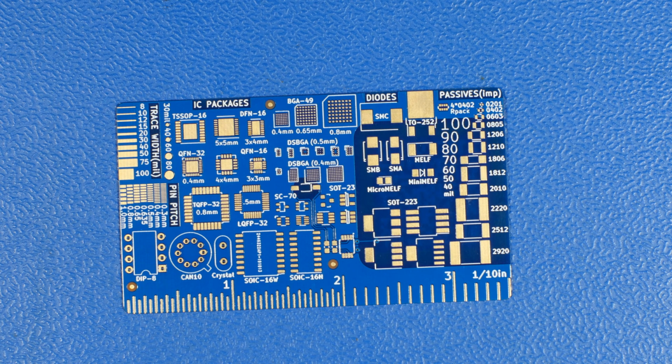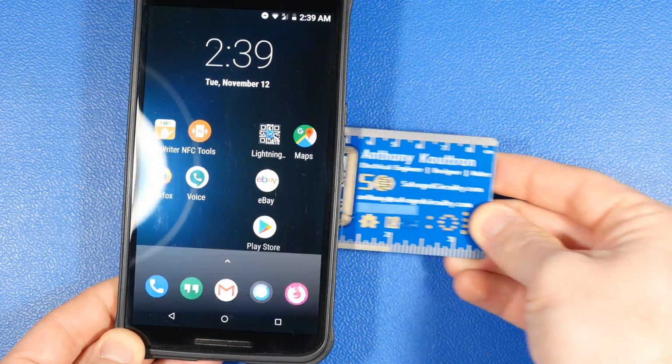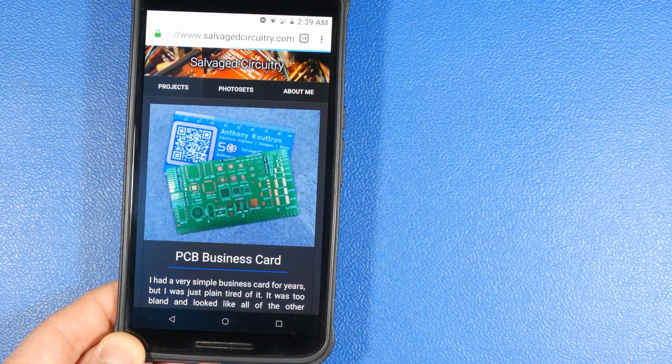Because this business card will be handed out with or without components soldered in place, leaving almost 1/3 of a card side blank was not an option. I chose a happy middle ground where a small amount of components were placed over the backside of the coil. It's not ideal, but all this card has to do is transmit a website and make an LED blink. An imperfect antenna should work just fine. Here's the business card in action. Works like a charm. I designed this in KiCad 5.0.